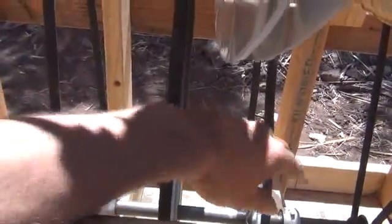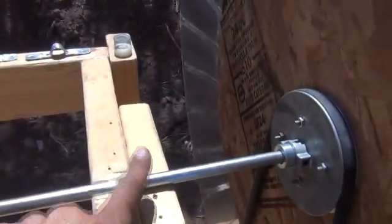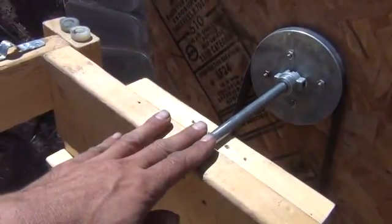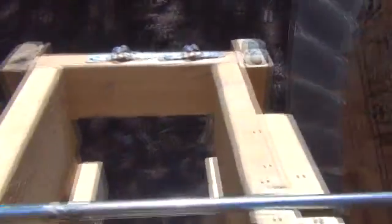That's going down to our 10 inch pulley. Now both belts are the same size, but when you loop one over itself it makes it a lot shorter than the other one. So I've incorporated a little tensioning pulley to keep the other belt the same length — that one's just a straight belt. This is the center drive system — just a half-inch shaft going across. It holds itself there because the belt's pulling it down. I've got some notches in the 2x4 that keep it into place, with strapping on both sides that keeps it from walking out.